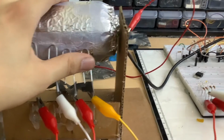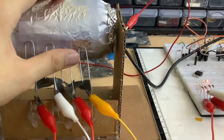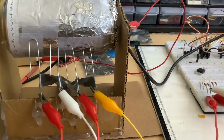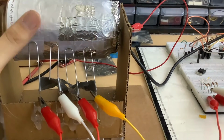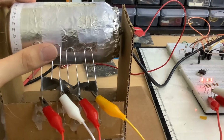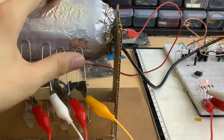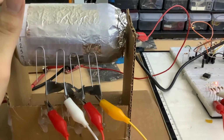So, for example, this could step through instructions, and this could be the current address in ROM. And then it'll go to address 1, address 2, address 3, address 4. And then, for example, we could have a jump instruction, and that could say, okay, go back. Reversing the can is not really good because the paper clips are pointed up. So what it could do is just cycle back through, and if we want to go to address 1 again, then we'll go back, and then we're back at 1. So that's how a conditional jump could work if this is the program counter register.